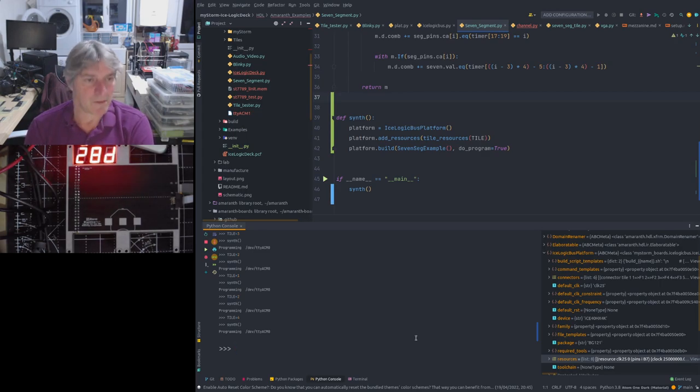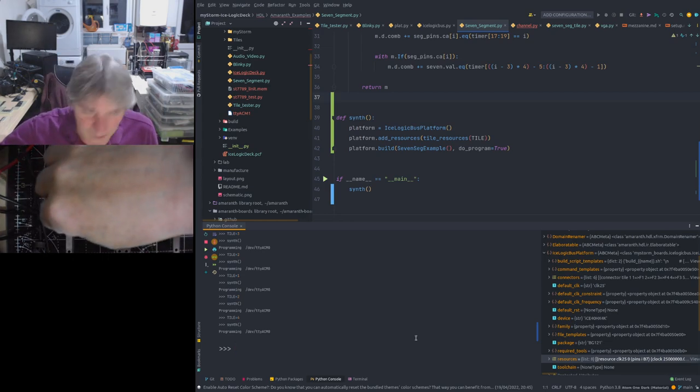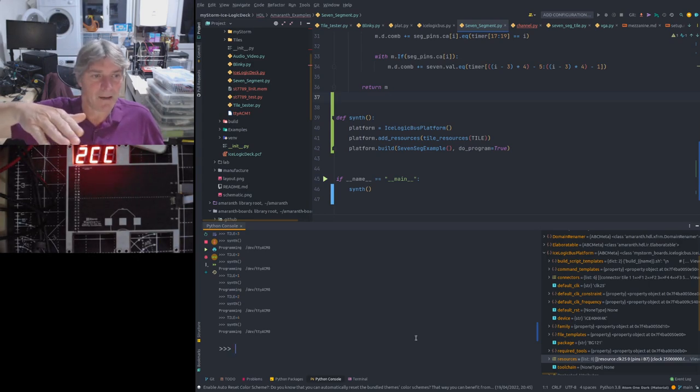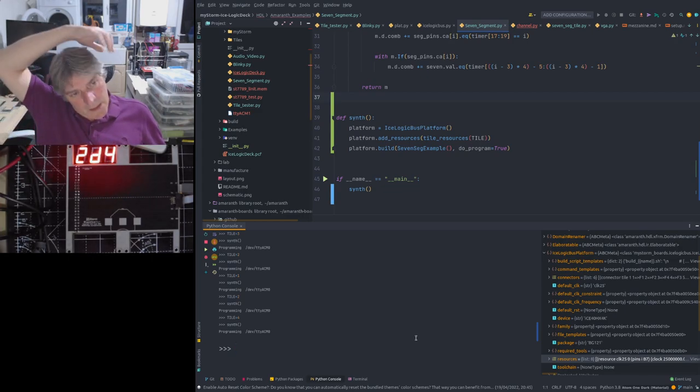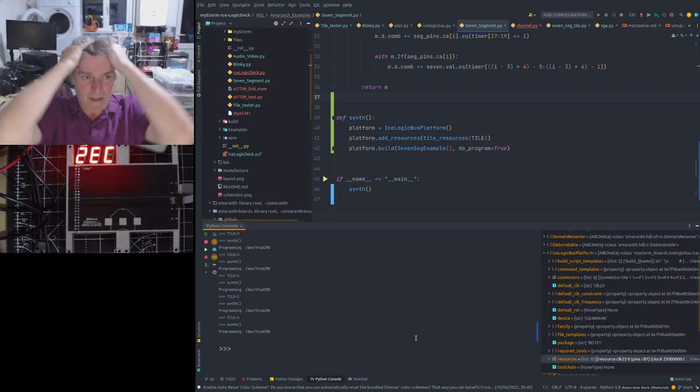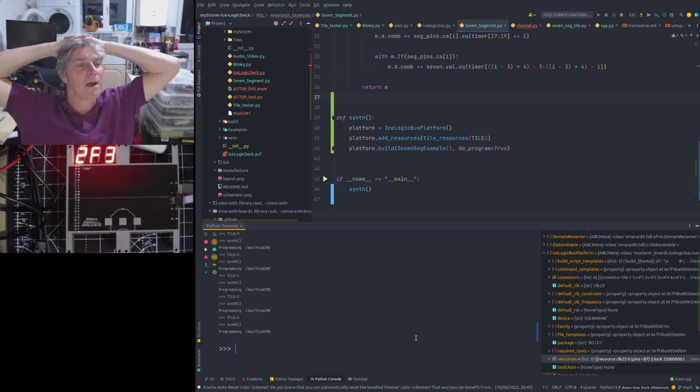Also, as you know, I'm not hugely enamored by PMODs. Mechanically, they are a bit of a nightmare. But also here, the problem we've got is three-dimensional, because of the level at which they sit. Once you add tiles onto the bottom, suddenly your PMOD is sitting in the air. So the more I look at it, the more I think about it, the more I dislike having the PMODs on that. And I actually would like to go a different route.